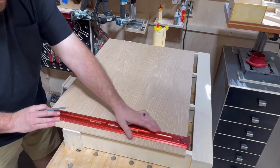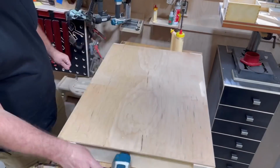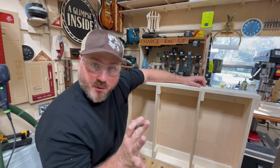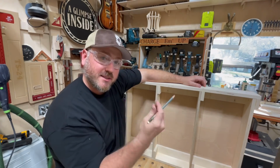Now I'm going to make these marks. That way I know where to brad nail into this, put that 1/4-inch piece of MDF veneered hickory, and we're good to go. Except, make sure you put your lines you just drew on the other side so you can see them.